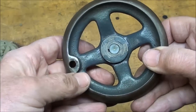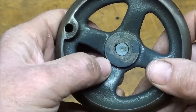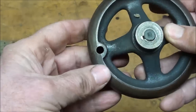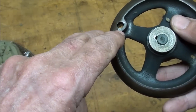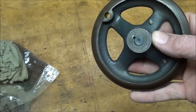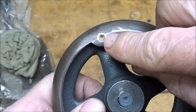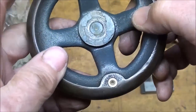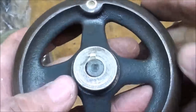I have to take a little Roma Plastilina and fill the keyway on both sides, just a dab, and smear it off. We can either fill that with clay, or use a piece of material like I did here with center holes — and I think I'll do the latter. I have a brass plug in here, center drilled. I center drilled both sides, because there's no extra charge, just in case. And I filled the keyway with clay.